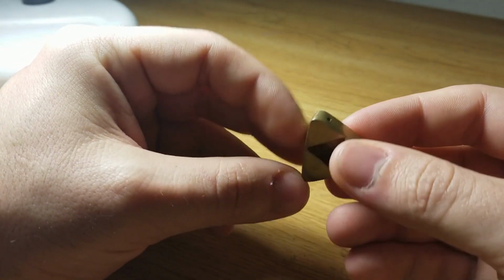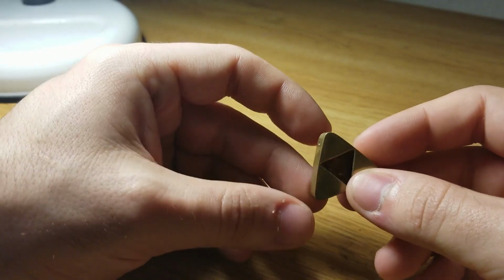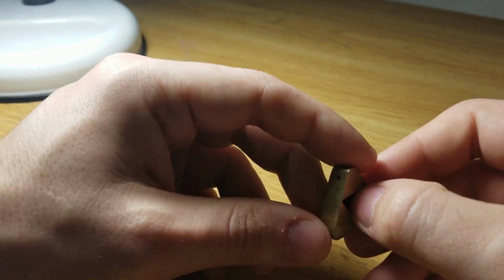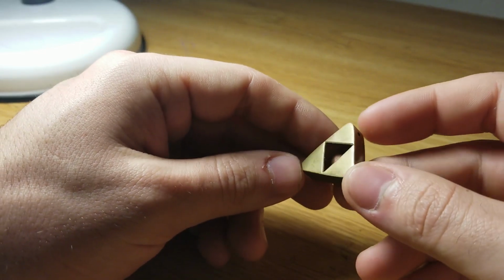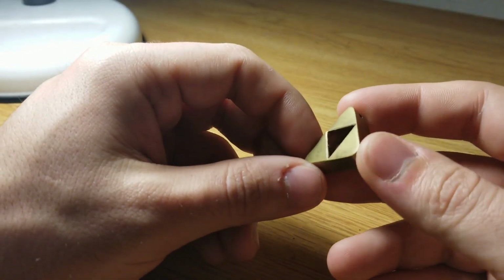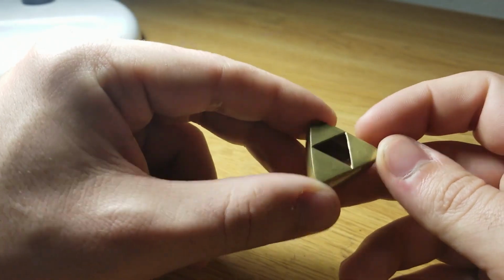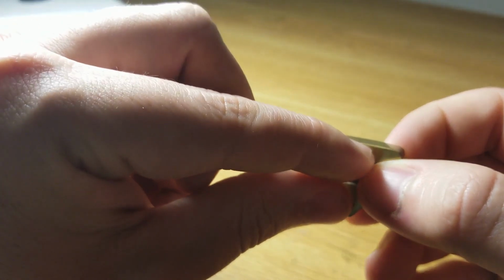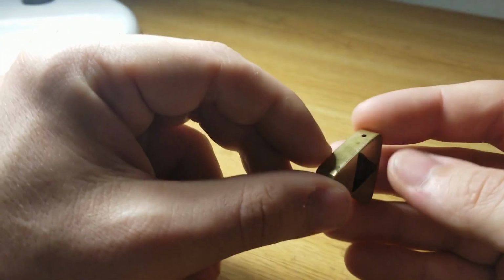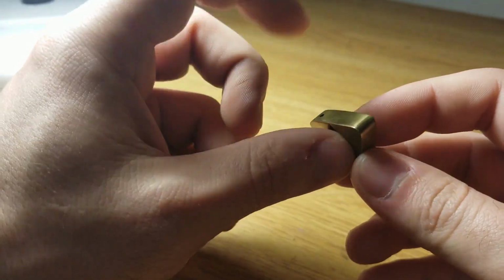It was required to have 2 holes in the top, but I also wanted to have this hole in the middle. If you don't have a hole and you create a solid box of metal that you're superheating all the time, it's gonna explode, because of air pressure and heat and whatever. This was initially a smaller triangle so that it actually had some wall substance up here. And I soldered that together the same way I did the bottom layer.